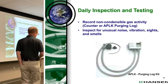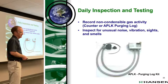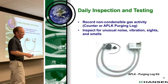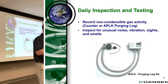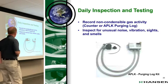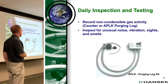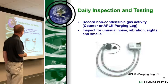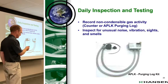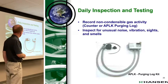If you walk by a purger and you're overcome by the smell of ammonia, it's not normal. I mean, you can smell ammonia. One of the advantages if you don't do it every day is that you notice those things. What we would say is it's different for different people, the level of the smell. Some guys smell it as soon as they walk onto the grounds of the facility. Other guys have to be right on top of it and next to it before they smell it.